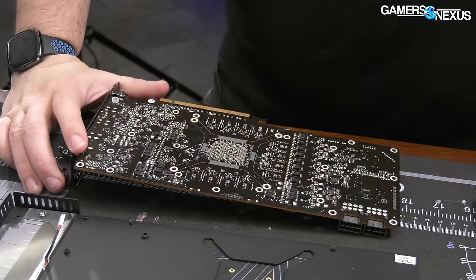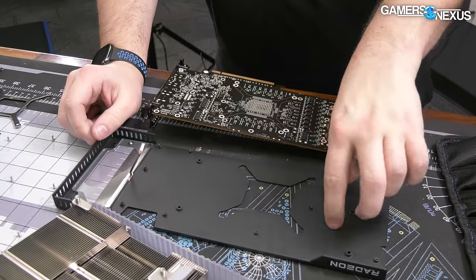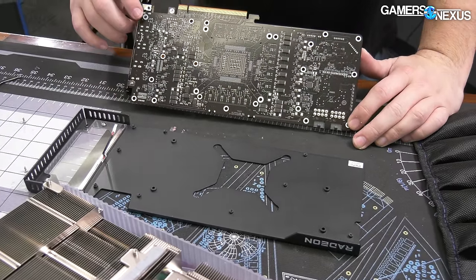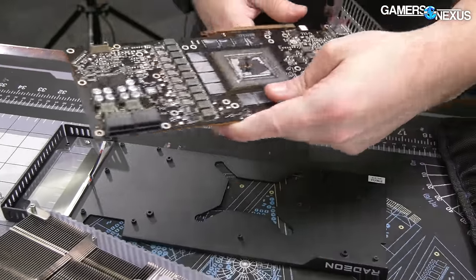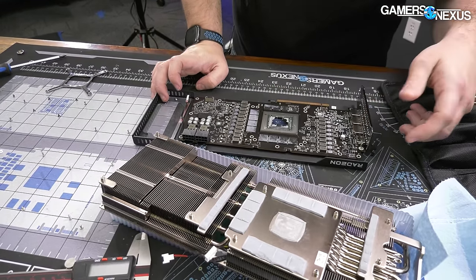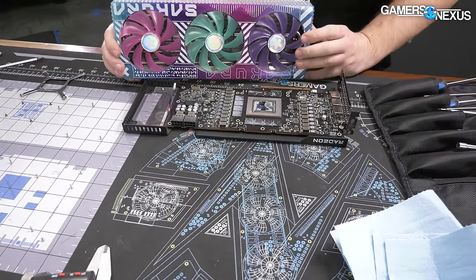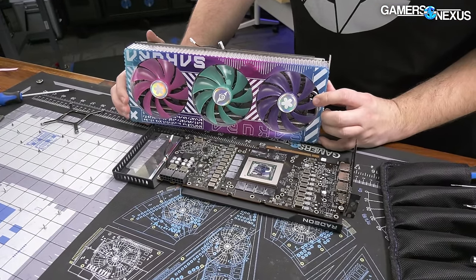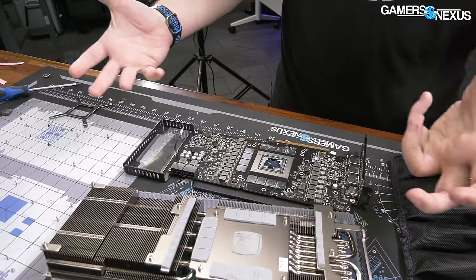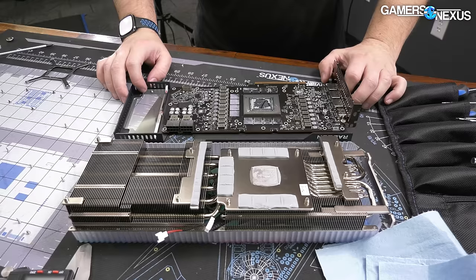The back plate is not really leveraging any thermal function here - no contact from thermal pads to the board - just art and maybe some rigidity. That's okay as long as the design is good enough elsewhere. Overall there's a very solid design for something that is clearly looks-driven. Yeston has actually built a real product, making things that look more interesting than the typical black and red gaming card while still having the functionality. Pretty easy to work on overall, other than the initial scary amount of force required to separate the two halves.